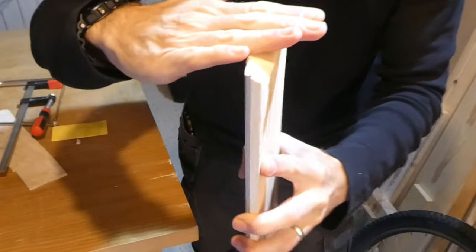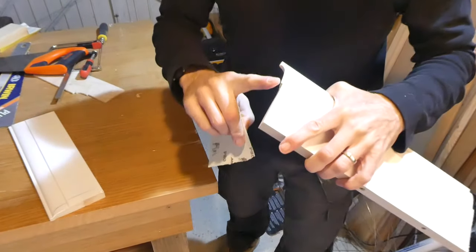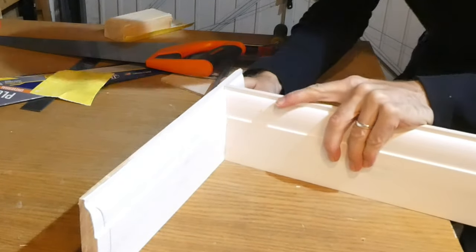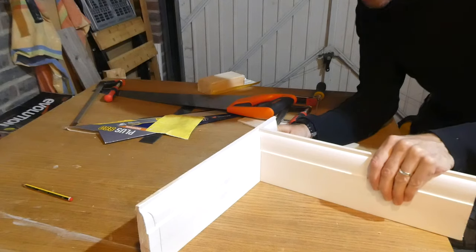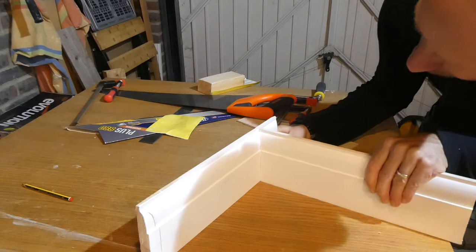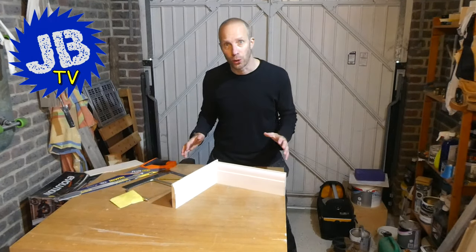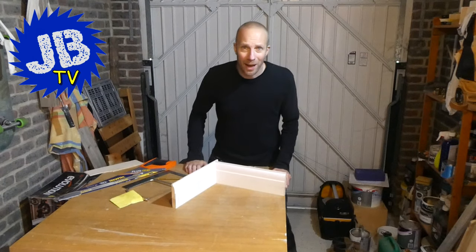Here you can see how I've put a bit of an angle on it, and again that will just allow it to move backwards and forwards very slightly. Also, by putting a slight angle on it, it just makes it a little bit easier to sand it down if you need to make any minor adjustments. And here we go — wow, look at that, absolutely perfect! As I've said, if it wasn't quite a perfect 90 degrees, any small amount of movement doesn't make a huge difference on the joint itself. So there you go guys, that is how you create your perfect internal scribed joint — don't forget to like, share and subscribe!